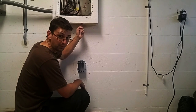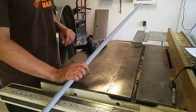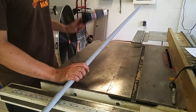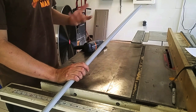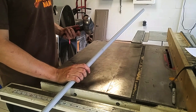Because the hole into the box is about an inch and a half away from the back wall, I'm going to have to bend the conduit tubing just a bit. I know they sell curved PVC conduit, but I've never had much success getting it to follow the exact curves I need. The plan is to use a heat gun to soften the PVC pipe and bend it into shape — when it cools, it'll hold its shape. This thing gets to 900 degrees, so for safety I'll be working on a metal surface.